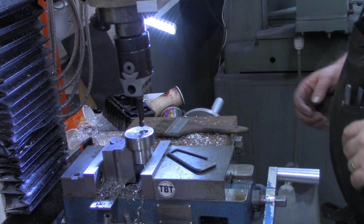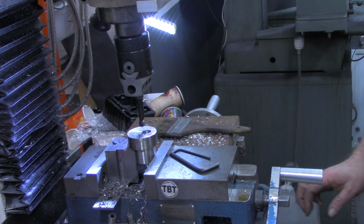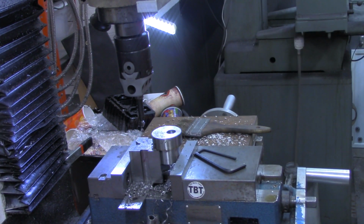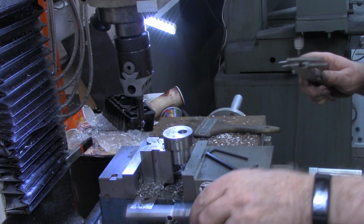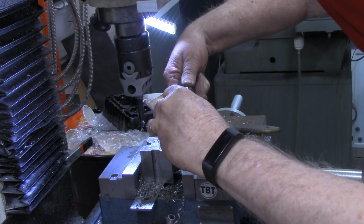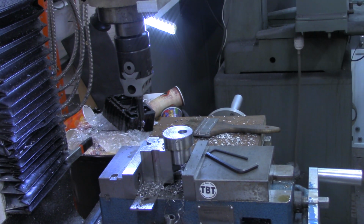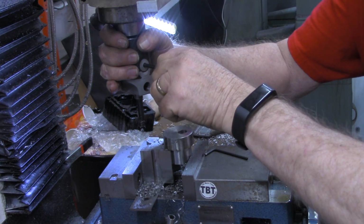All right, like I said before, I've got the DRO set, and I'm going to bring this out and get a little measurement on it. And the largest gauge pins I have go up to a 1/2 inch as well. So remember, this is going to serve as a gauge pin. That's showing 13 millimeter, about 510 thousandths. So that's saying we've got a little less than 40 thousandths left to go. Again, I'm only going to take 10 at a time off the dial though.